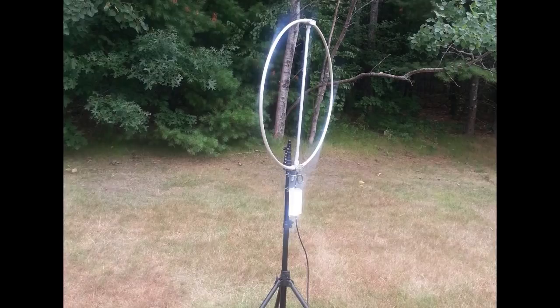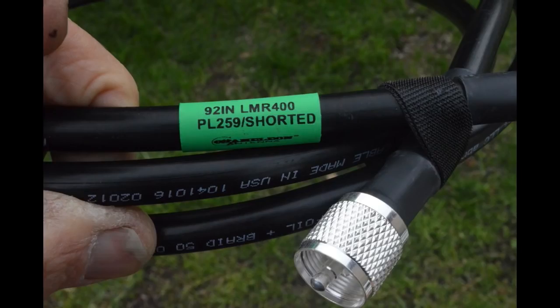So the higher the Q, the lower the noise, and on transmit, that means no harmonics, and that's a neat thing. Now, loop efficiency is equal to conductor tube diameter and conductivity of skin effect. So the pliable loops are great for packing in your vehicle, or as Tracy of the MTARA team does, he sticks it all in a neat backpack with the Alex loop. Flexible conductor, low loss coax is a great way to go, remembering the square root of frequency loss law.